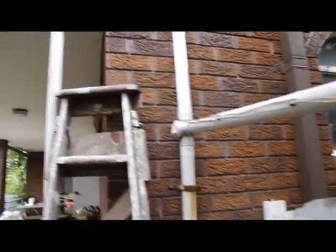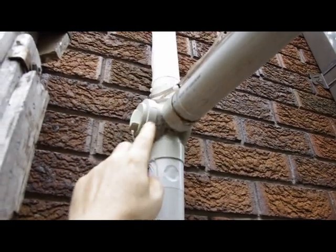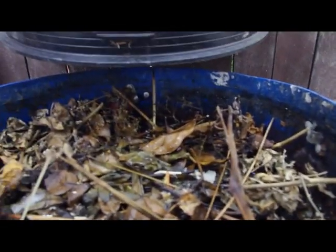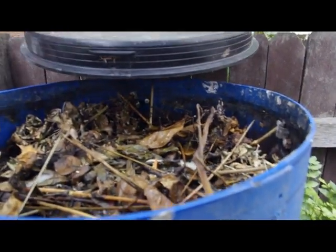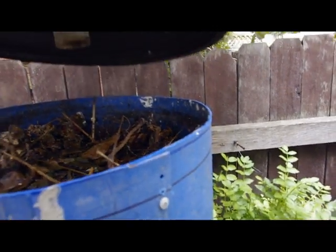The water comes through this pipe from the kitchen. There's a grey water diverter here — if you need to work on the system you can throw that and the kitchen water goes down the normal drain. So the kitchen water comes in here and I've just got a mulch bed. You can see there's just mulch in there, with coconut fiber underneath. I had a micronic mesh here before but found this simple mulch column works best. It's the easiest to maintain — it collapses down over time and you just top it back up with mulch every couple of months or so.